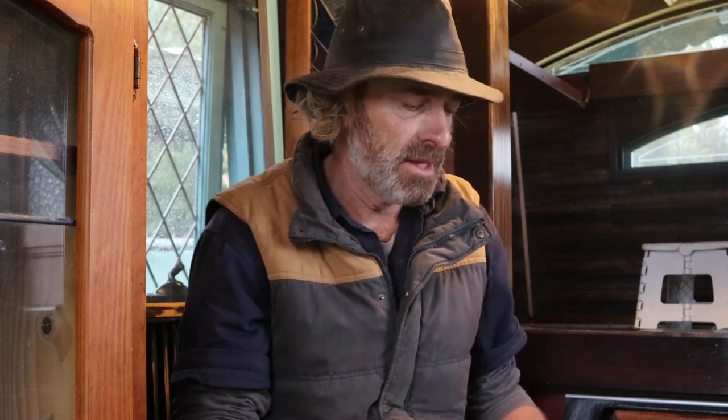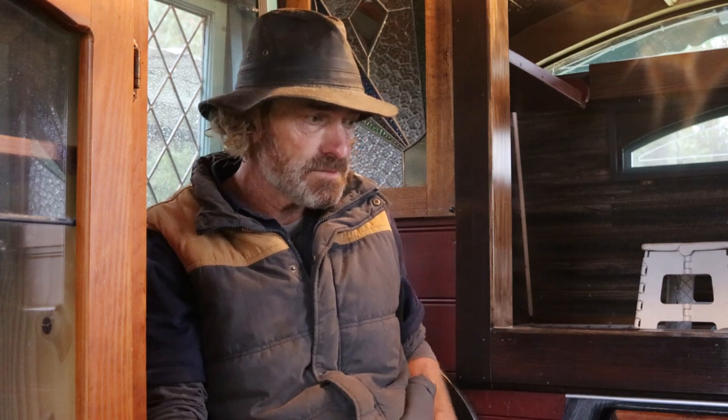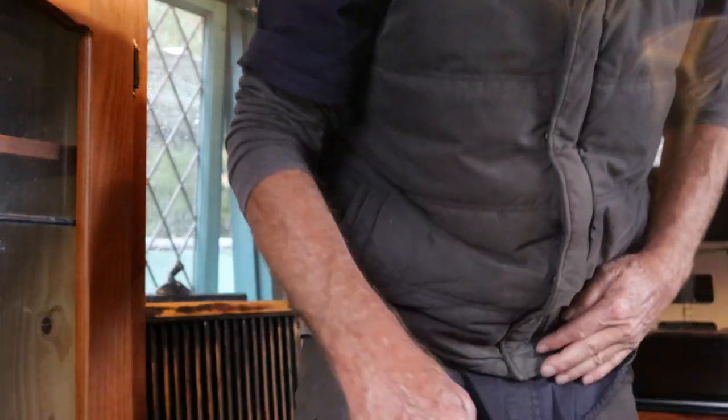The Decra mesh around the inner flue is very warm to the touch. The triple skin is still cool, so that's going to do exactly what it's intended to do. I think it's time to close everything up and see how long it will take to get this temperature up. It's probably been going now for 5 minutes. We started at 12 degrees.